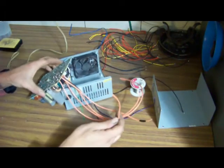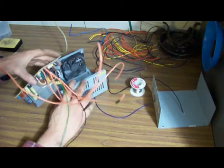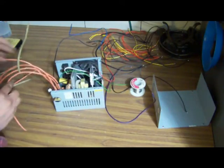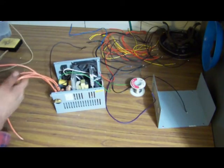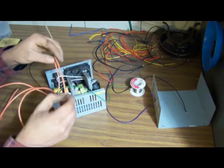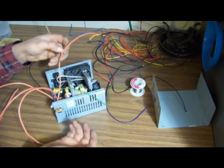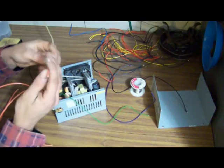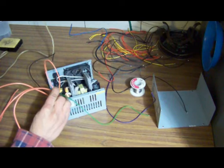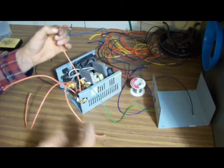The reason I did this, as opposed to twisting them, is it's a lot neater. And since they're all tied together to a common point, electrically it's a good connection. You've got one single wire carrying the current and you know it's not going to melt, because this is 12 gauge wire. Chances of you drawing anything higher than 20 amps is rare — this is technically good to 25, probably 30 amps, and not overheat.